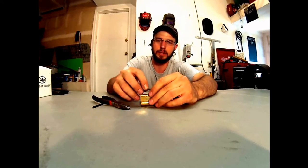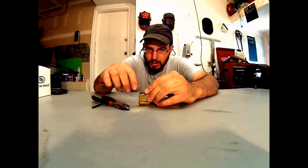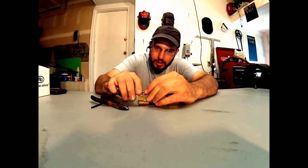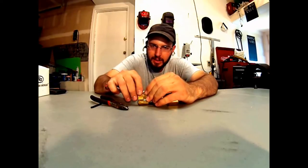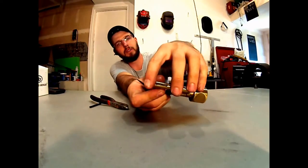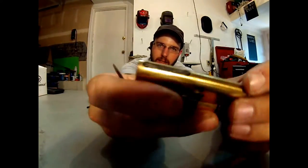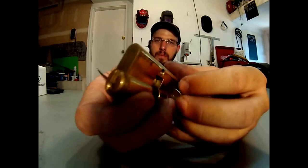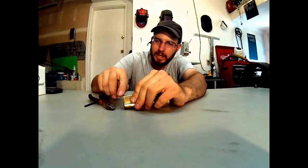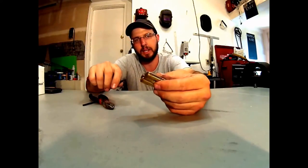You would just take this and cut it directly in line with that, like so. After you put everything back in — your top pins and springs — you'd then be able to take this and gently tuck it in all the way. It's going to mount flush just like that. It's one of the few things that fits identically perfect right inside there, so it's going to allow you to slide this back into your cylinder and reinstall this piece. And then when you want to re-key it again for the next person, you just grab the rubber and it comes right out just like that.